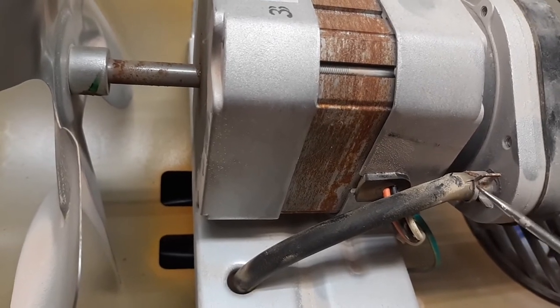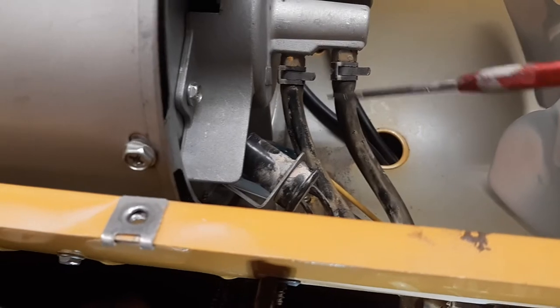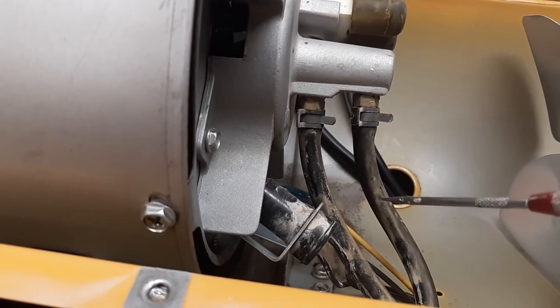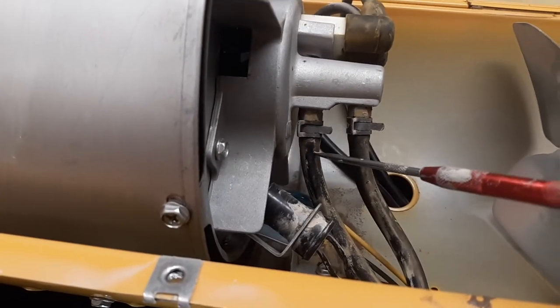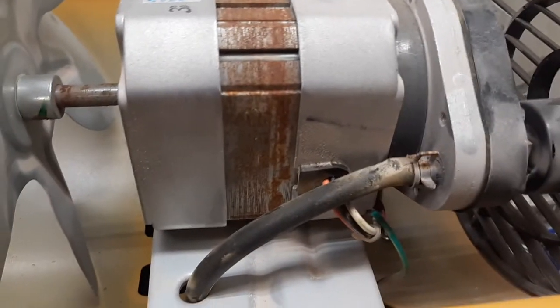The crack in the airline has been eliminated. I looked in here and I don't see anything else, but I'm going to take a closer look. You pinch these clips off and pull your hose out — twist it and it'll pull off. Same thing here. Don't mix these up, because if you do it's never going to ignite. This is your airline, and this is your fuel line.